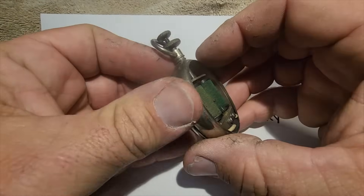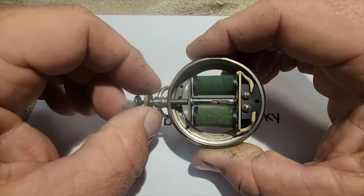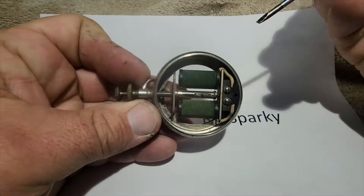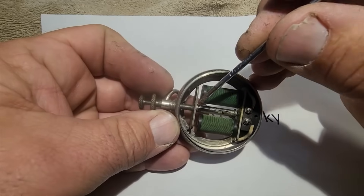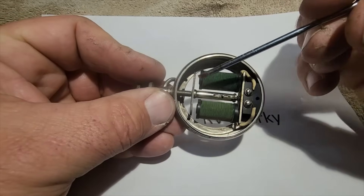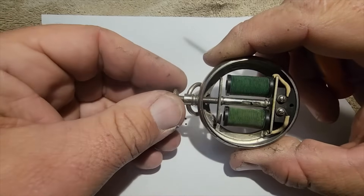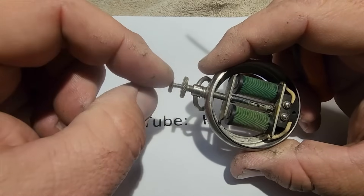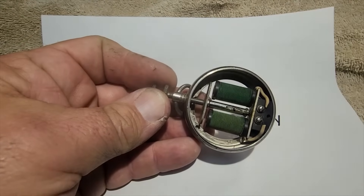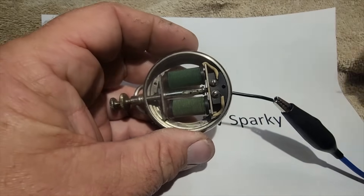It's a little bit easier if we take the back cover off to see what's going on. The large knob was completely jammed — he was unsure it even turned — but there are threads on it, and by being very gentle and working it back and forth I finally got this knob to turn. What it does is increase the gap on what I would call the armature, in electrical terms, between these two coils. My speculation is that the larger the gap, the more energy it would take to close it — to pull it in — so the technician could get an idea of the signal strength on the line. The center knob pulls an adjustable spring down the middle, and that spring adjusts how much tension is applied — another way to measure how much energy is being used.